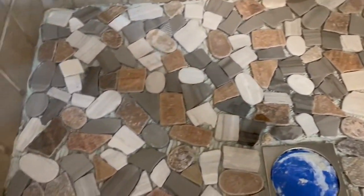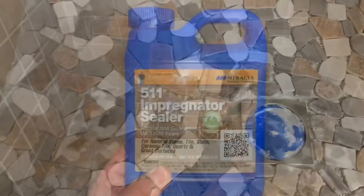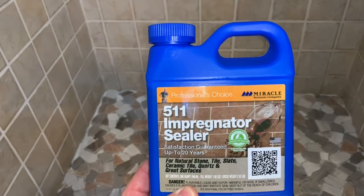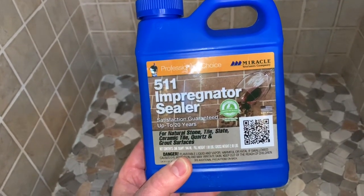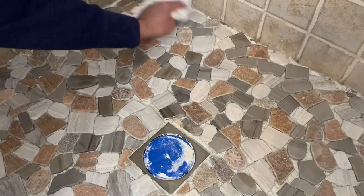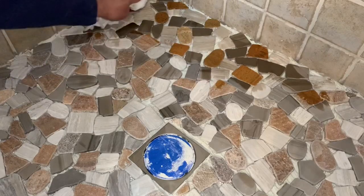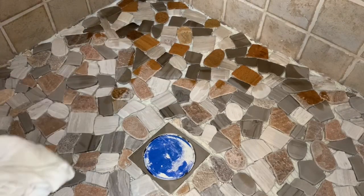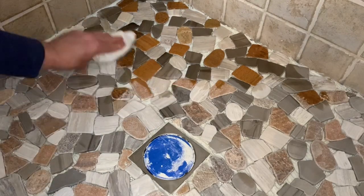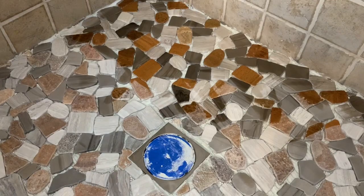I've just been cleaning this area up, cleaning up the walls and mortar I've spilled, and tomorrow should be a finished shower floor. I'm using this 511 sealer - you can use this as a sealer for stone, but I'm going to use it as a grout release, which is another use for this stuff. It's pretty easy to use - you can roll it on, brush it on, or just use a white rag and wipe it on. You want to get the surface damp but not get the grout joints excessively wet. Leave it on for a couple of minutes and then wipe off any excess. This will make grouting a lot easier and you could do this before the sheets are installed, however since I had a bunch of small sliver pieces to do I figured I'd just do it now.